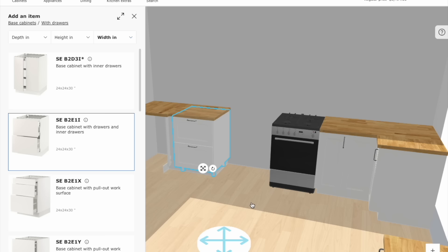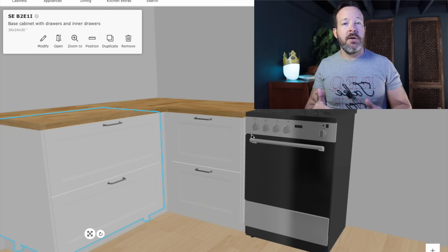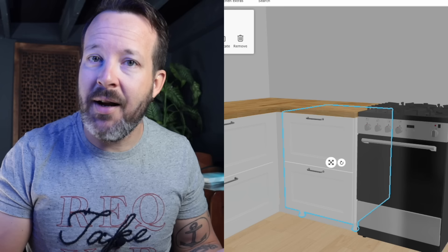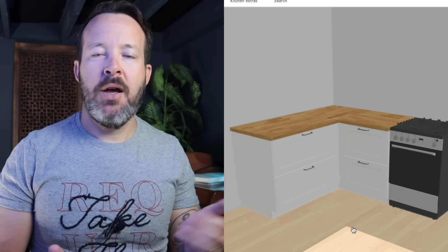By blocking off that corner with this base corner filler and adding a larger drawer bank that suits your needs — say you had room for a 24 — you can add a large drawer bank, and on the other side put another large cabinet, maybe a 36. Blocking off the corner lets you make better use and better access of the space to the right or left of it. This drawer bank is much easier to use than digging around in a corner base, regardless of whether it has a lazy susan inside. Having a drawer bank makes it much easier to store things and access them. The fact that IKEA makes this so easy is a real bonus.